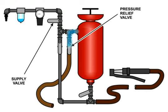And if you've installed one, open the pressure relief valve to depressurize the pot. If not, you can continue to shoot abrasive out your nozzle to depressurize the pot. The relief valve just helps save abrasive.